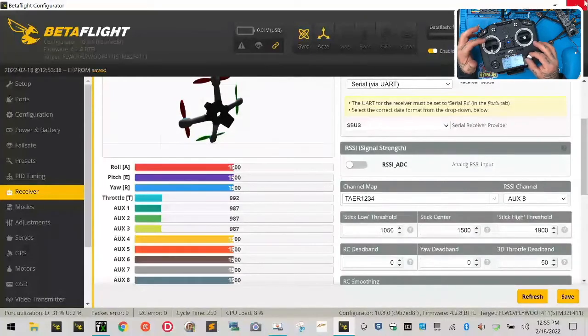So I'm going to go ahead and click it and turn the min to the right until I get to 1000. And then I'm going to take the throttle, put it all the way up, go to my max, click it and turn it all the way down till it reaches 2000 in Betaflight. Hit enter. I'm going to exit out of that. I'm going to go to my channel 2.